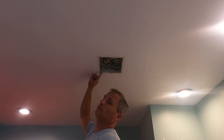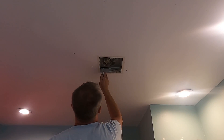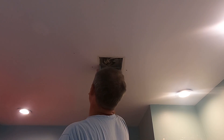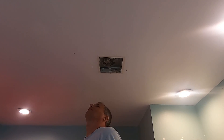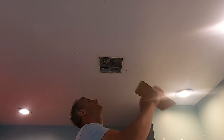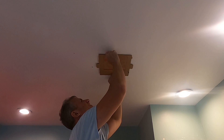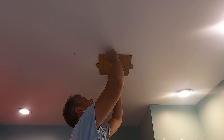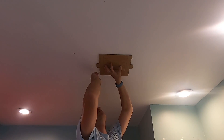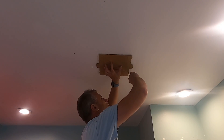Most likely these old fans are connected against a rafter. So I'm going to find the rafter — it's right here on this side. What I'm going to do is split the difference, so if you look and I go this way, they're the same size. I'm going to split the difference and the reason why is so I can get access to unscrew this old exhaust fan. So I'm going to square this out.